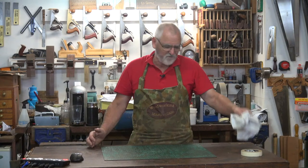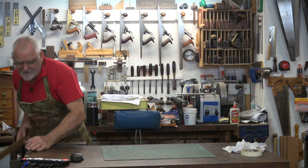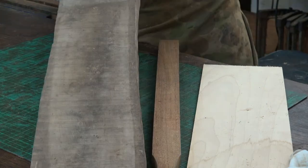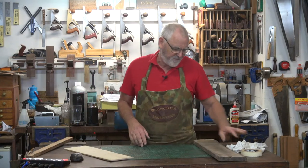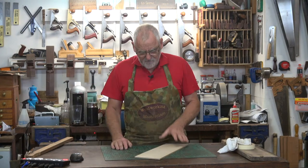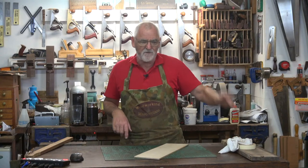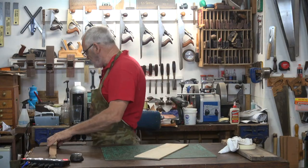Okay. What am I doing? Strops. Let's do a strop. Well, this is one I found that I'm going to do. And then there's a bit I literally had lying around outside. So I'm going to machine that up. That sandalwood will come up a treat. But before I go that far, I'm going to draw a template, and then we'll make a half template, then a full template, then I'll machine up the sandalwood, cut it roughly on the bandsaw because I can get to the bandsaw now, then we'll router it and glue it all together.